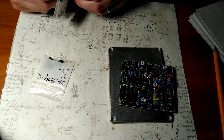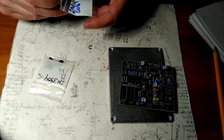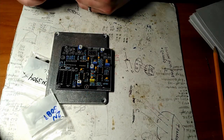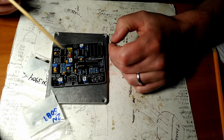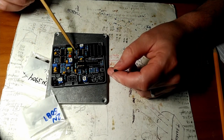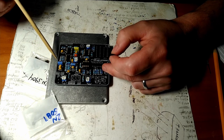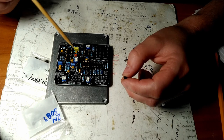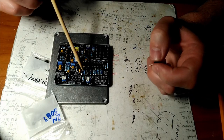The other thing you want to do, if you're substituting, is put one of these in. 5087, this is Q2. Let's find Q2 on here. Q2, what is this guy? Missing a capacitor. We need to put him back in there. You would think this would be easy to find by now. 12 seconds later, ah, here we go. You've got Q1 and Q2.